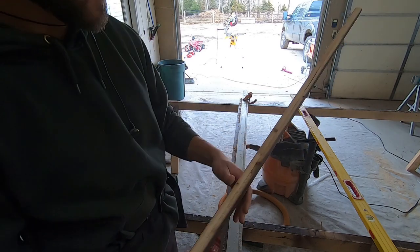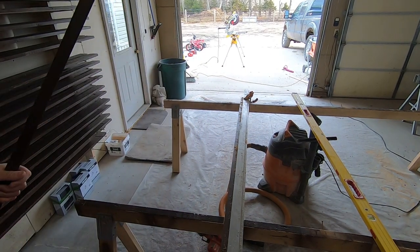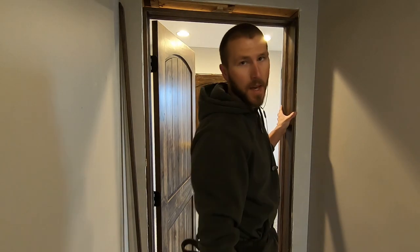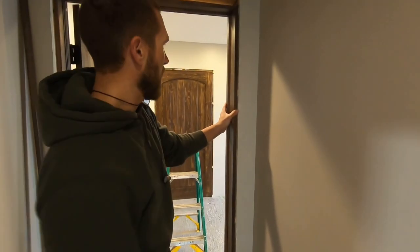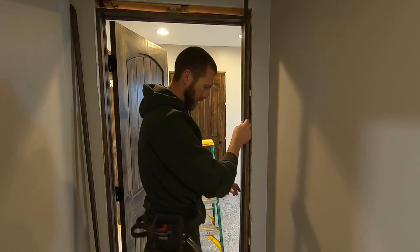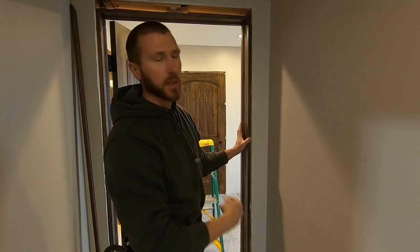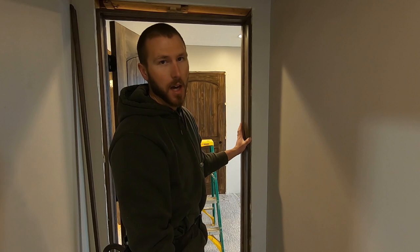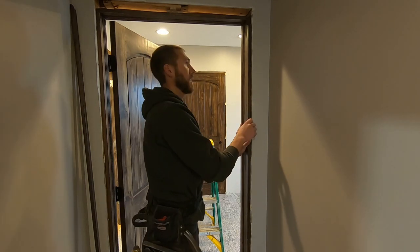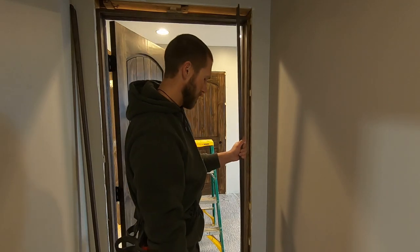Using a track like that gives you a really clean cut that'll pair up nice. If you have saw marks or blade curves — like if you ran it through a table saw — you're going to have to sand those down for a seamless transition. I got all my pieces cut and I like to double-check them. Now I'm going to take my 18-gauge nailer with two-inch nails, apply glue to both sides real lightly, test-fit all my pieces, and make sure they're right on the money.